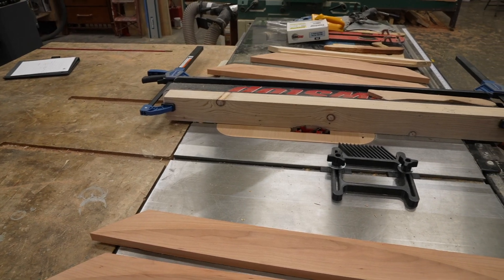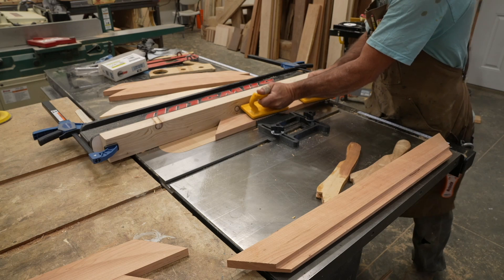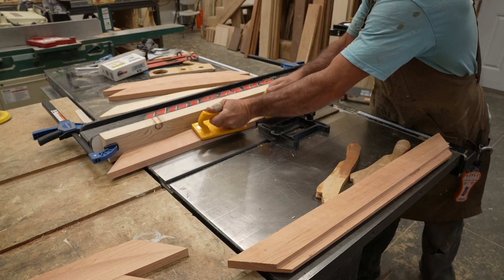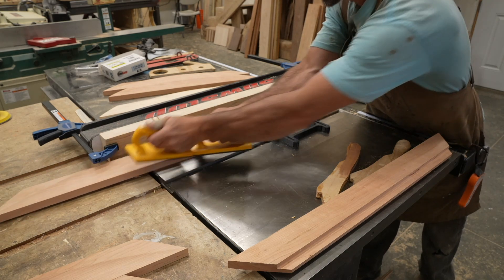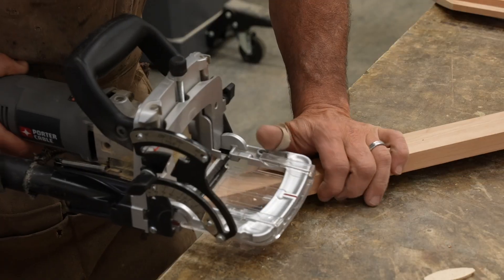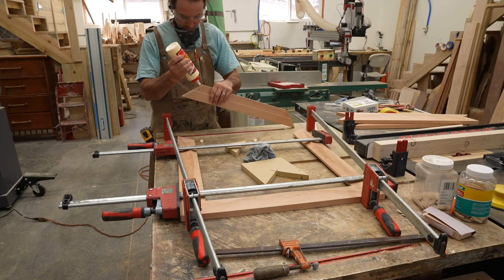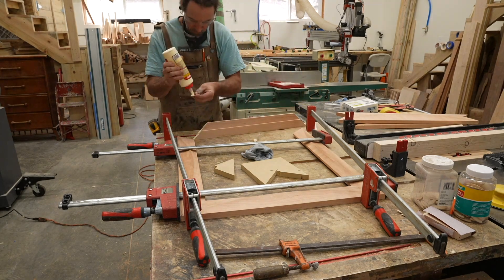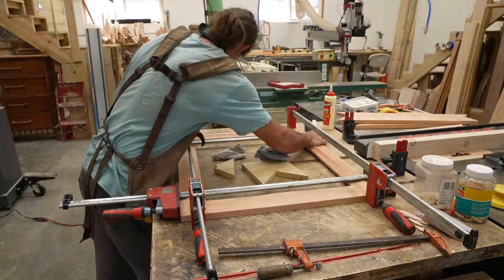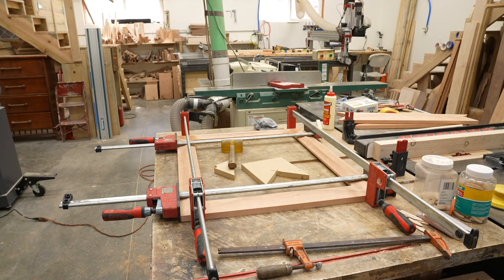I had to create a groove in the backside for the mirror, and I decided to use my dado set on the table saw. I did it in two passes, and a trick is to bury the dado blade in a sacrificial fence — you don't want to cut on the side just because it works better and is safer. I really do need to buy a domino because this would be a great place to use it, but I used a biscuit joiner. The glue-up was a little bit tricky, and I'd probably make some type of jig if I did this again. I ended up using two clamps in each direction — one lengthwise and one crosswise — and adjusted them to get the corners really tight. I wasn't focusing on a perfect rectangle, just no gap in the corners, because that was more important.